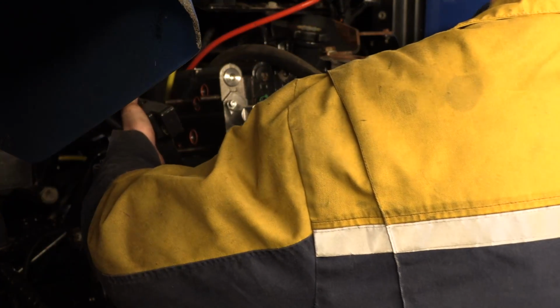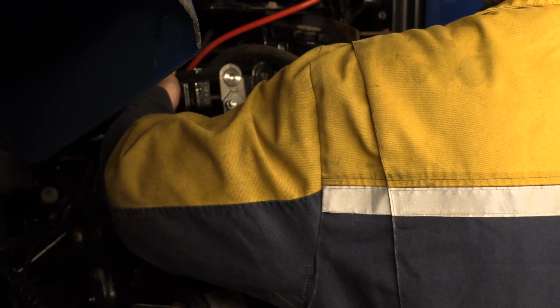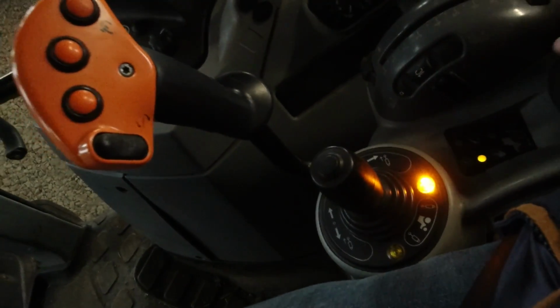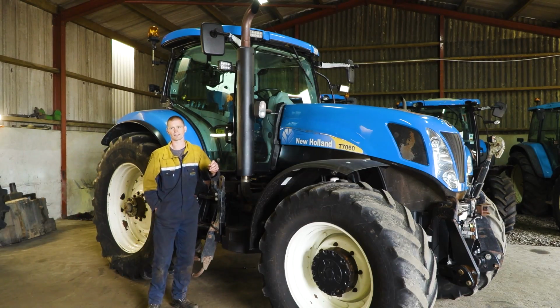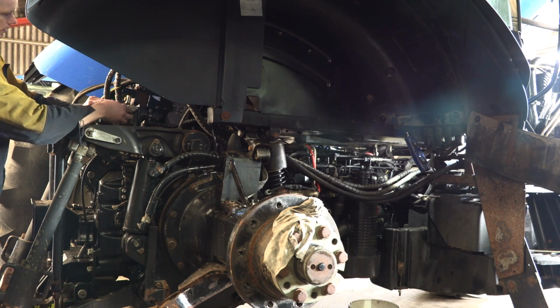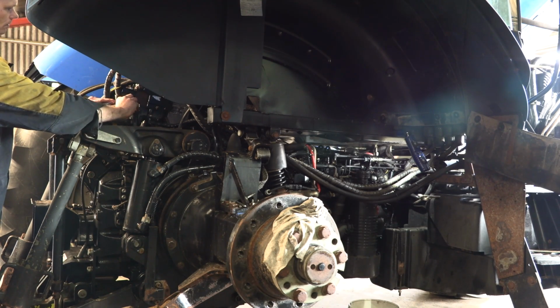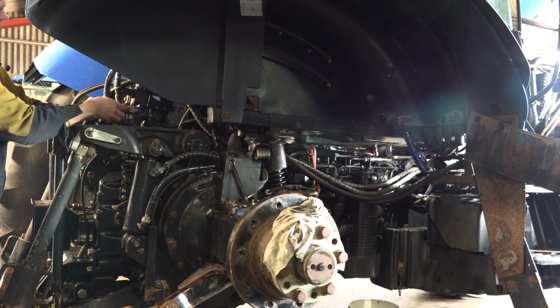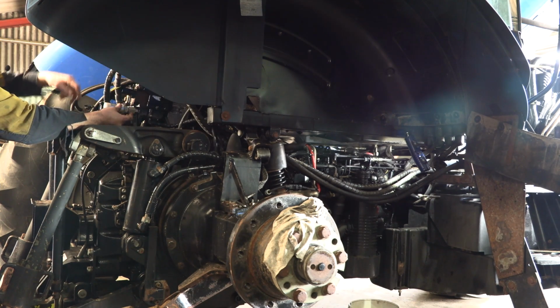Coming from that as well, you were explaining to me, whenever we came up, we jumped in it and we drove it, we seen the joystick. Naturally, I thought there was a mid-mount, but there isn't. The joystick, you can switch your main spool valves onto the joystick for handiness, just on your seat, so you can work all 4 spools off the joystick. So we plumbed in the front linkage pipes and behind spool valve couplings on number 1, number 2 spool, so it's more usable. You can still use your 5 spools if you want, plus you still have your front linkage.